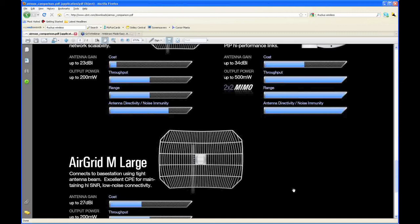One of the most frequently asked questions in this grouping is about protection of these radios. Can you talk a little bit about lightning and surge protection that goes with your radio system? Yeah, definitely. I could talk about that one. It's pretty much a standard grounding system. For all of the installations with our devices, you want to make sure that you're using shielded cable and not low-quality cable either. You can get some knockoff cable from China that's pretty much garbage and won't really provide any protection. But you run the shielded cable down to one of our grounded POEs, and you make sure that POE is properly DC grounded. Make sure the electrical outlet is actually grounded.